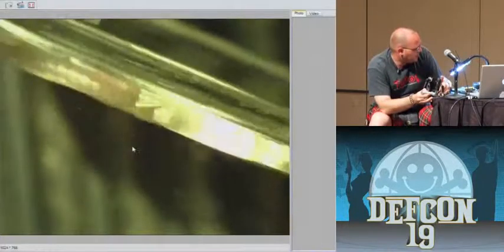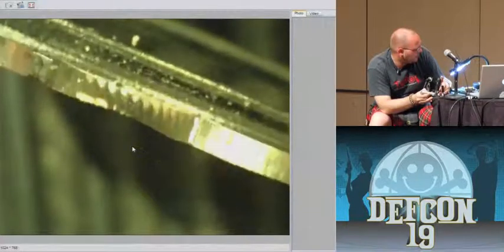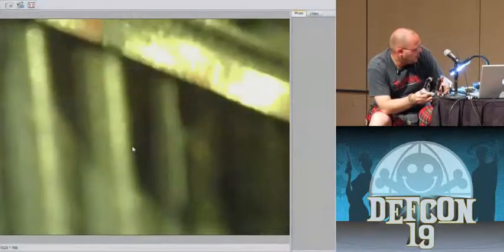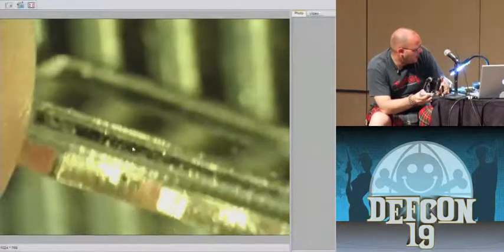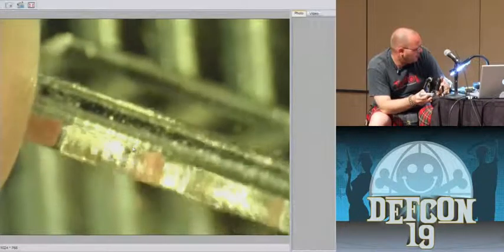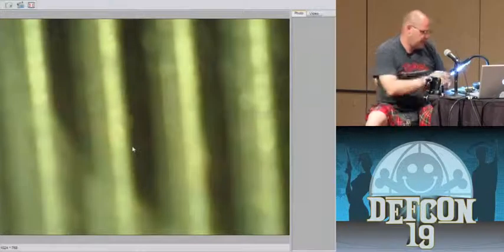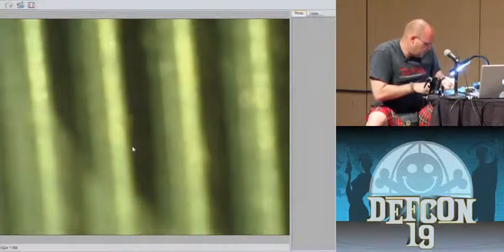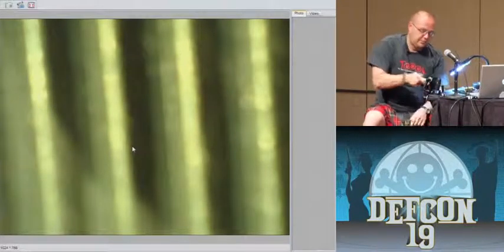That's your position number one, that's position number two, where again we see a dot. There it is. And on the last position, I saw one that's not that clear. Well, actually more clear here than there. So I'm going to take off one step at number five and one step at number two. And we have an open lock.